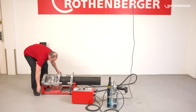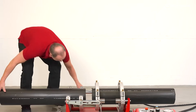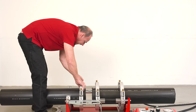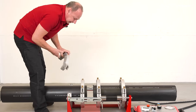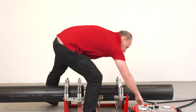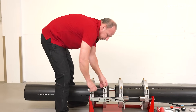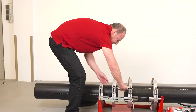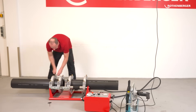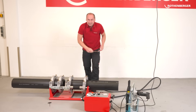Completely sufficient — it won't fall off again. Next pipe — clamp this one too, and again with the last basic clamping jaw. Then secure the pipes so that they can no longer move under the required welding pressure. That's what this ring ratchet wrench is for. It is supplied with the machine so that you can do this quickly. So the pipes are now attached.